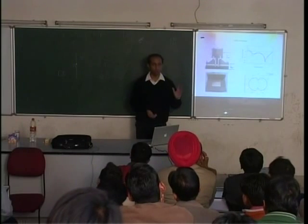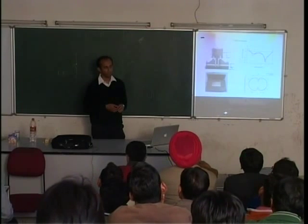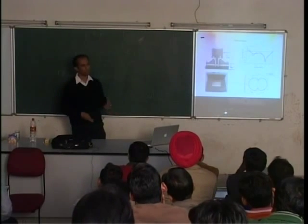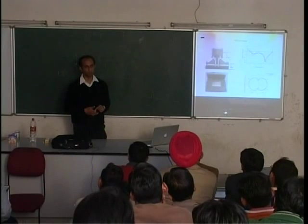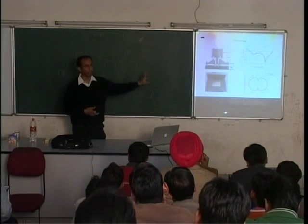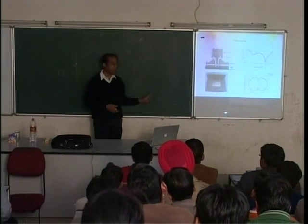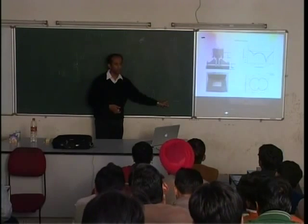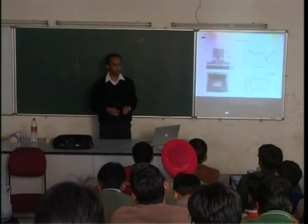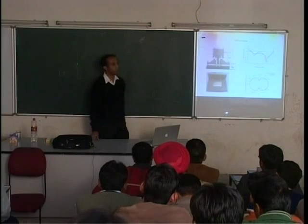Very small gain. For UWB antennas, we don't want gain. They don't work with gain. They are supposed to be omni type of antennas. What is the point of this? How do we develop a system using such communication? That's a big topic, UWB communication systems. Very interesting things have been developed. This is only a small part of it. This is the antenna. The antenna is not the very important part of it. The important part is how to generate such pulses, how to separate this pulse from that pulse, because there may be many transmitters and many receivers operating in this one room in a UWB environment. So how does the receiver know whether this pulse came from that one or that one? Those are all system aspects.